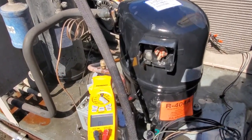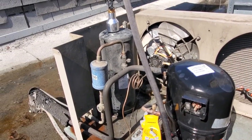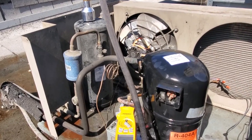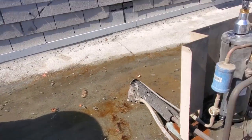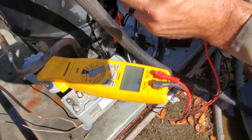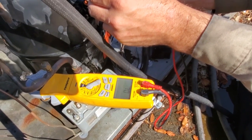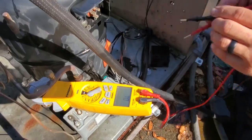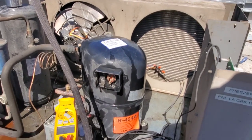I've been letting this run for about 20 minutes or so. The problem is we're out in Palm Desert, California — it's probably about 110 today — and their water temperature is probably 85 degrees, so it took forever. Once I cleared the lines, the water is probably down to 80 after flooding this whole area. We're reading continuity now: 1.08, 1.06, 1.08. So we reset thermally inside the compressor. We're working on changing that condenser fan motor and then we're going to try to start this guy up.